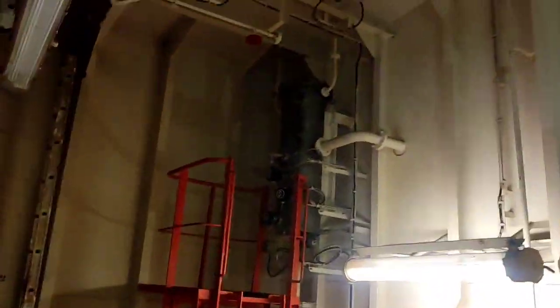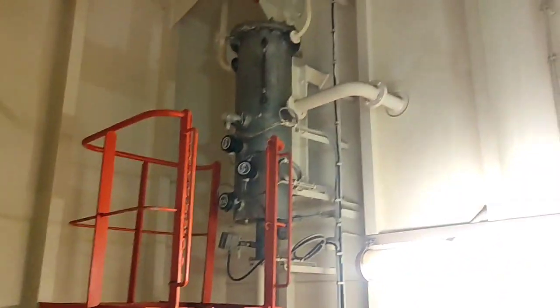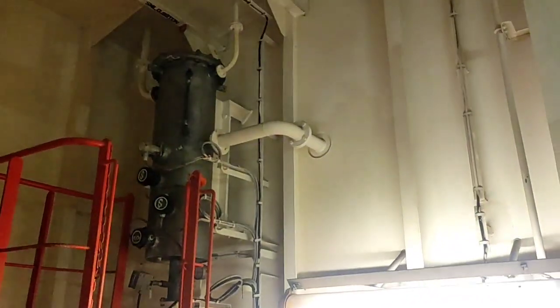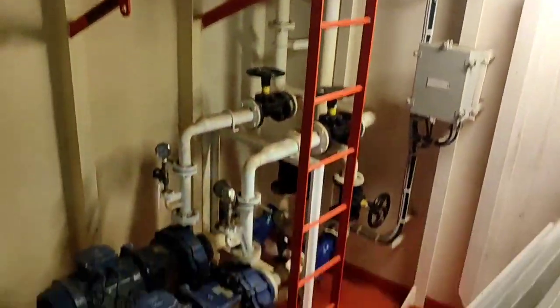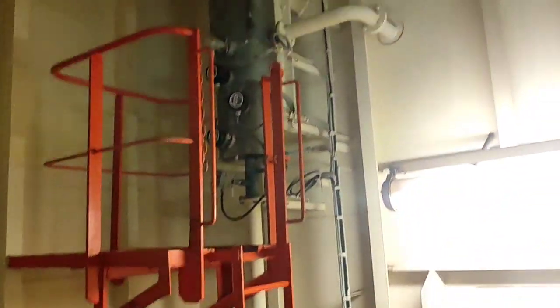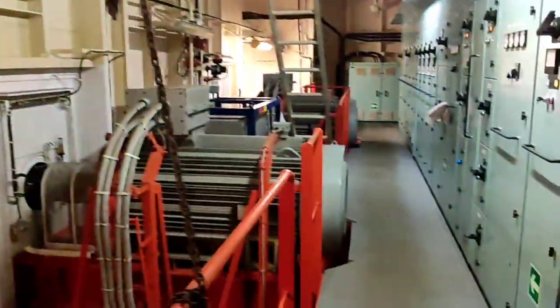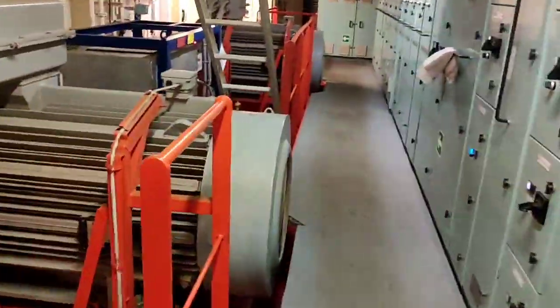On the port side, you can see the glycol tank filled with glycol coolant. There is a heater also to maintain 35°C. Then there is the glycol pump which circulates the coolant going to the compressor.